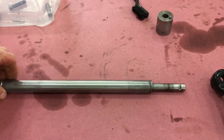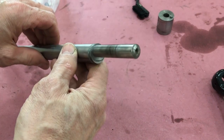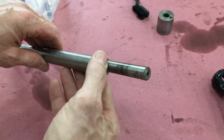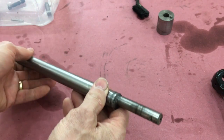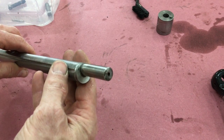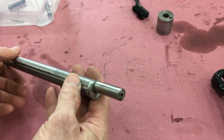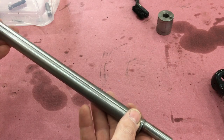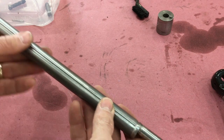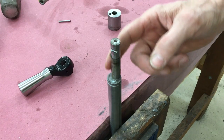The eccentric shaft is just that — the last inch or inch and a half is eccentric from the rest of the shaft; it's not aligned with the center. So as you move this shaft, it will engage and disengage the back gears. You can also see a groove cut in the shaft to distribute the grease pumped between the shaft and the eccentric sleeve.